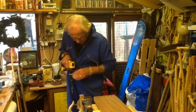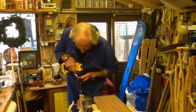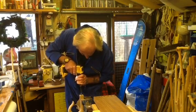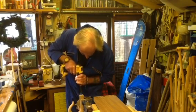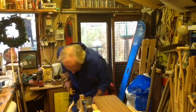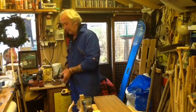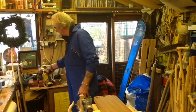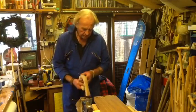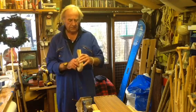Because it is going down through a joint line, it's tending to pull to the one side. But if you leave the shaping off to the very end, that's where you can accommodate that slight little bit of difference. Really I should have the drill press set up and be doing it in that, but it is a faff at times, so it is.